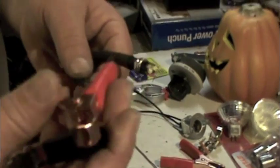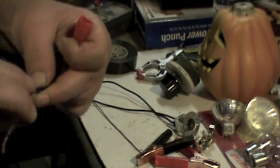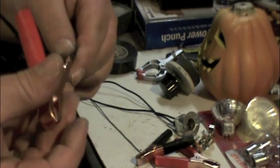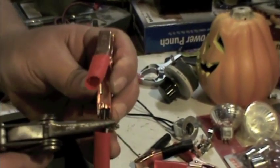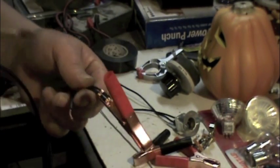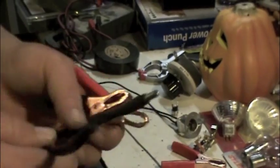So this is the connector — we got it. Now the other end of the cord is going to go to the battery. I need these clamps on. Always make sure the wire is insulated — put the insulation on first, it's going to be a pain later. Twist it, and you can even solder it. That makes it last longer. So you got both ends of the cord: the power supply and the battery.